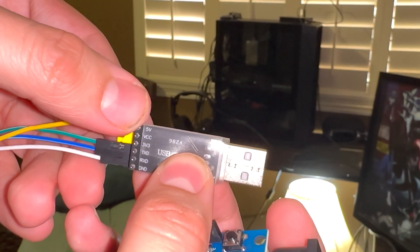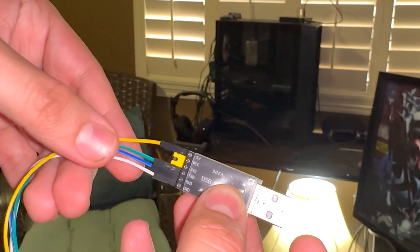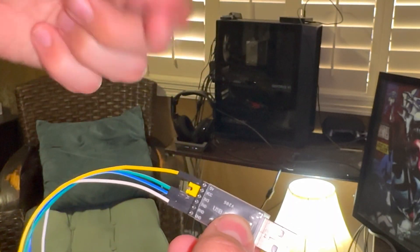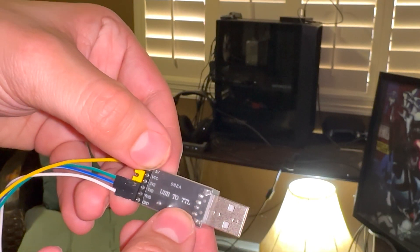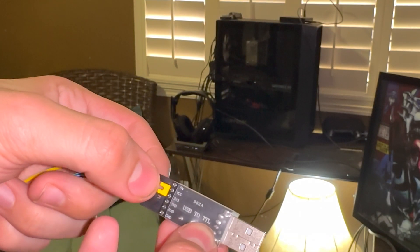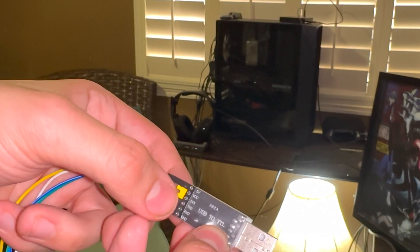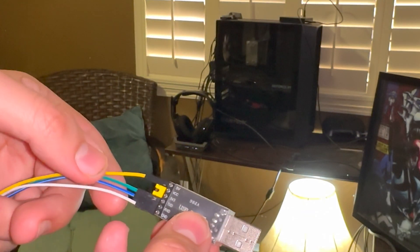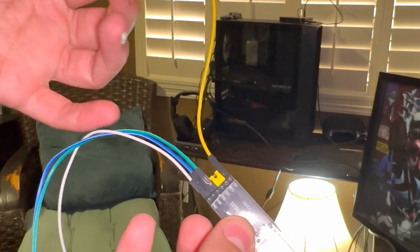Once you get your order, here you can see 5 volts — this is what's important. The wire colors might be different; they do not matter. I could take all these out and plug them in a different order and they don't matter. What does matter: you can see 5 volts here. I have the yellow gap as a blocker so you don't plug it into the wrong spot. Then you have your transmit TXD, receive RXD, and your ground GND.